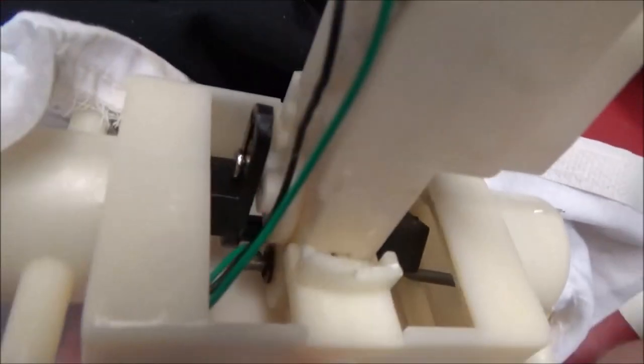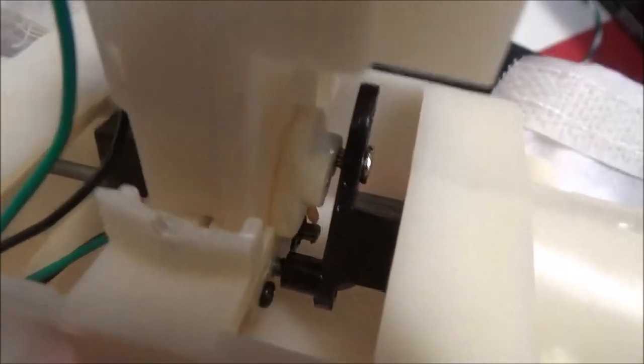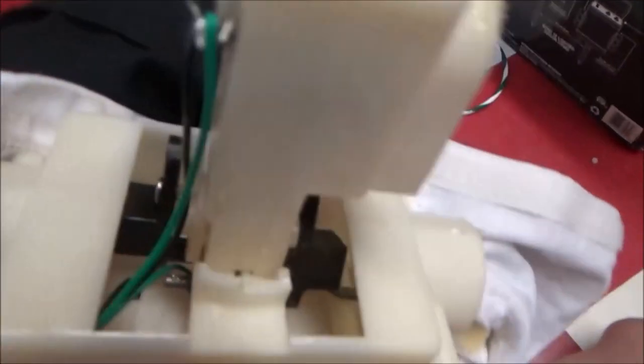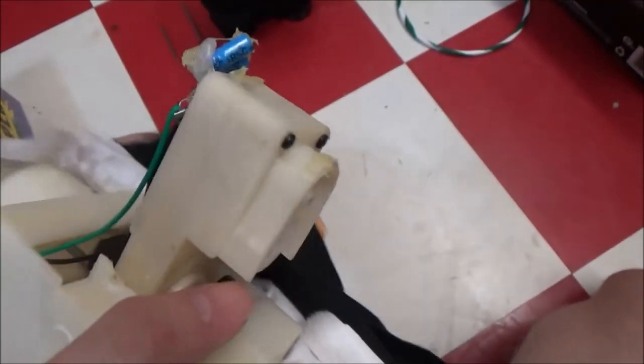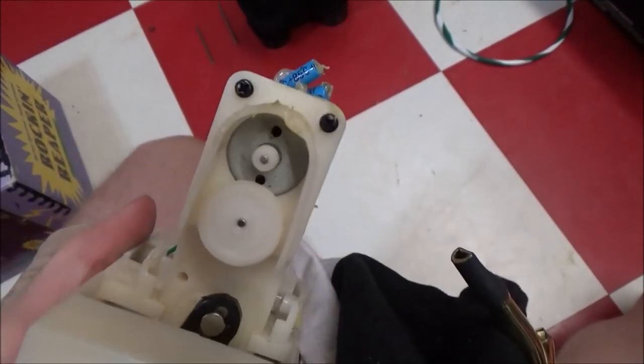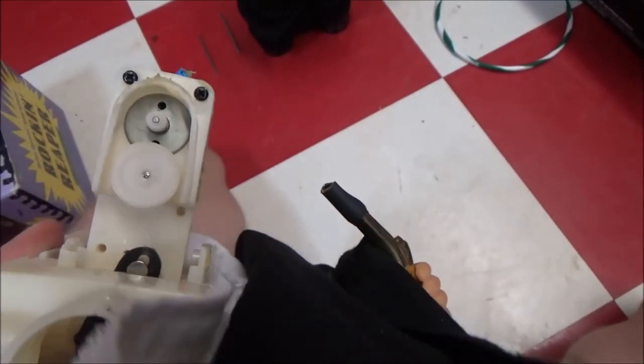And instead of pulling all this junk out from under here, because there's a lot of those pop tabs and pop rivets, and that's double riveted, so it's about twice as hard to remove. So instead of that, what I did is, now keep in mind, if the mechanism's yellow, do not do this, because it can increase the chance of it shattering. But I removed all four of these top screws and then the bottom screws. And then what I did is I split the mechanism open with a screwdriver, held it there, maneuvered the 8-tooth gear in there, and pushed this in, because it's an 8-tooth and it's a little bit way easier to get on like a 9 or a 10.